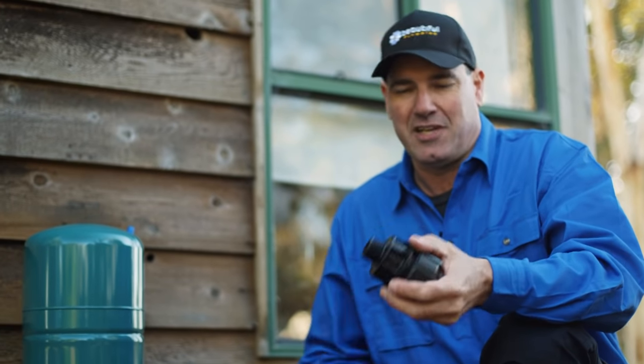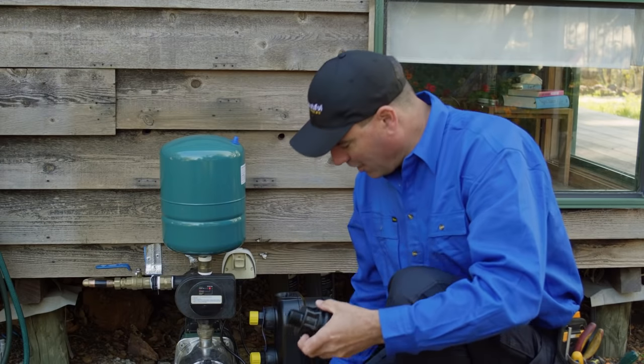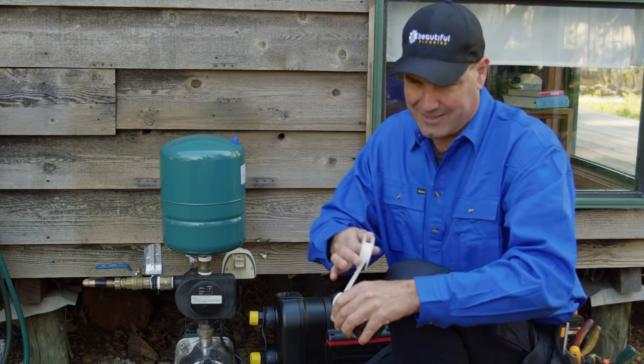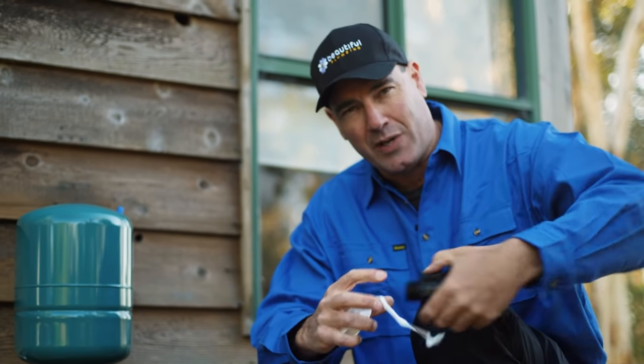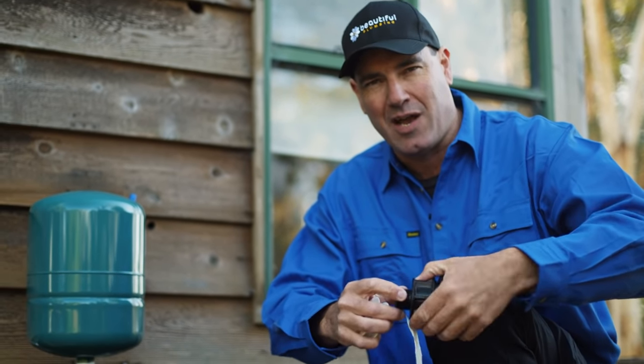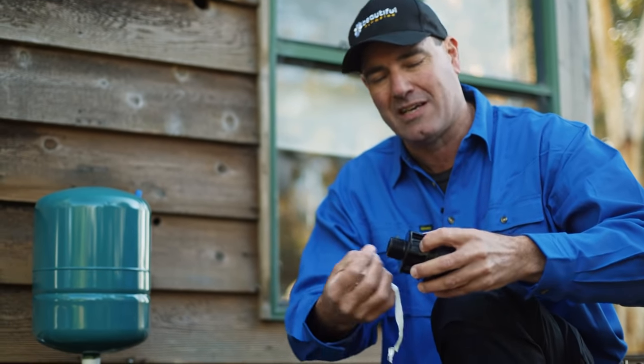All right, so this is something important too. When you have a plastic fitting with a thread on it, if you put your hand on it, you can feel it's very smooth. Now, if you go and put some thread seal on that, do it a couple times round, that thread seal can turn. So if you're screwing it into a fitting, the thread seal doesn't stay where it is. The thread seal stays on the fitting and it turns and it will always have a continuous leak.